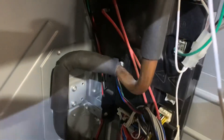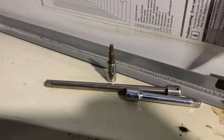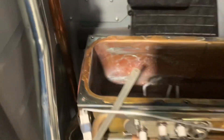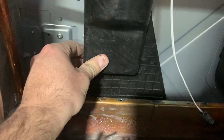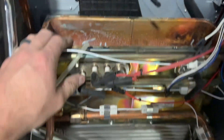There are four screws in the back. This one's a pain because you have this computer in the way when you're trying to get a socket in — they're all Torx screws. I had socket and extensions. If you had a different style Torx it might be a little easier. This one's a pain too because you've got the exhaust manifold right here that's in the way a little bit, but you can get it off without having to pull all this apart.